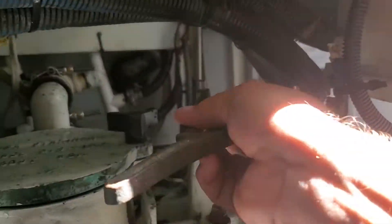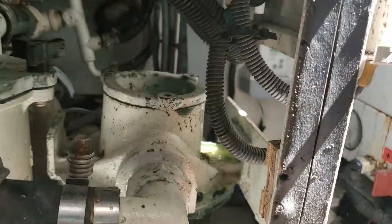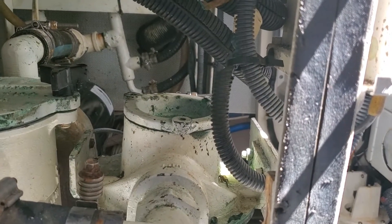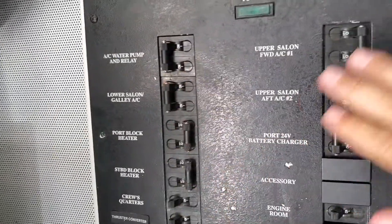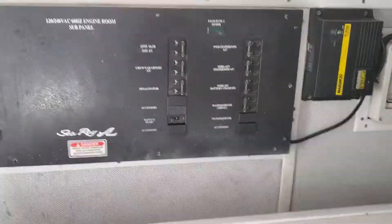With the proper tool, we tighten it better. Not all strainers have the same tool — some, like this one, have those two things to unscrew; some, like the European or Italian ones, have bolts. At this point we are sure the valve is open, so we can switch on first the AC water pump, and then all the other AC breakers we want on. Thank you so much, enjoy your video.